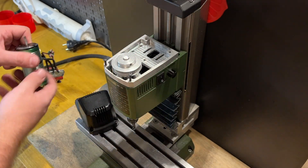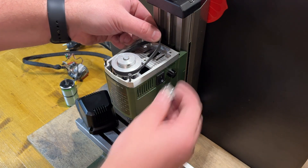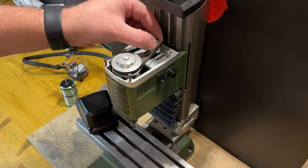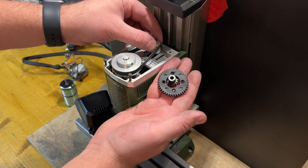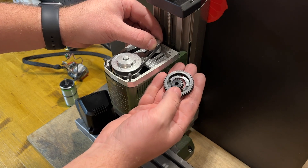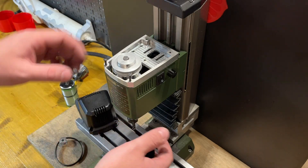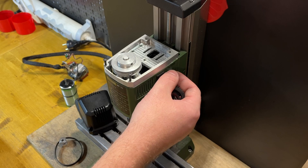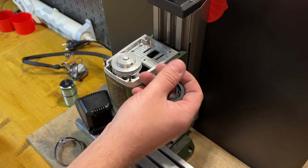When I'm running it at low RPM, it almost doesn't have any torque — I could stop the engine with my hands at the speed I'm running. So that's not really good. In the original configuration, the pulley for the engine is located here, and I want to add these two gears, which will reduce the speed of the spindle to almost three times compared to what I have now.